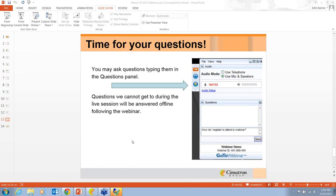I see one up at the top. Does Moldex 3D help in setting up the mold press settings? Yeah, it can give you good generic starting points. It can certainly get you in the ballpark quicker. But then again, as you change it at the machine, you may sneak away from the accuracy of the simulation. So under ideal situations, it's best to put the right process settings into the simulation, but of course you can run the simulation more than once. You run it at the generic, you look at it, you see what you like or don't like, and you can tweak it and run it again. So this is the value of the software, being able to run multiple iterations with different parameters to fine-tune the results.